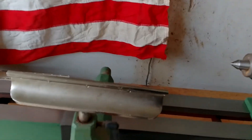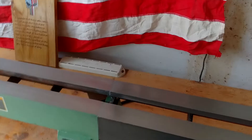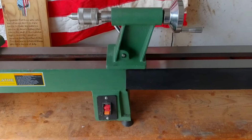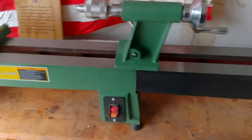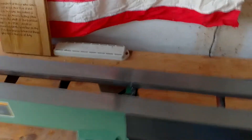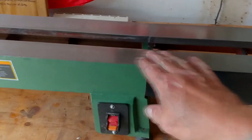But if you do decide to give this a try, I found out from trial and error here tonight — if you take your tailstock and put it right over the seam there, and then tighten your bolts down, it gets you pretty close. Since they're not machined to very tight tolerances, there was a lip here and here.